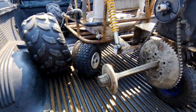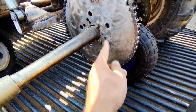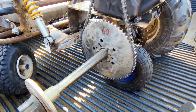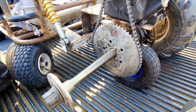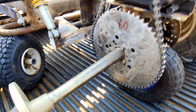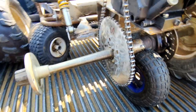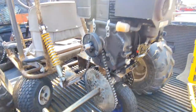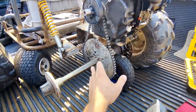Got the tire off on this side because I'm installing a couple more bolts in the sprocket — two more got to go in. Making sure the sprocket doesn't rip the bolts out, because there were only two bolts in there to begin with — that was definitely not enough for this size of power.